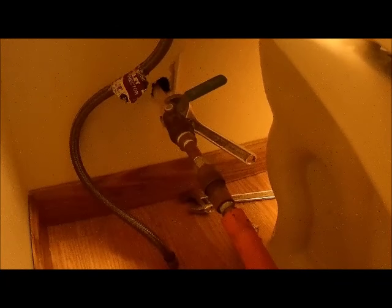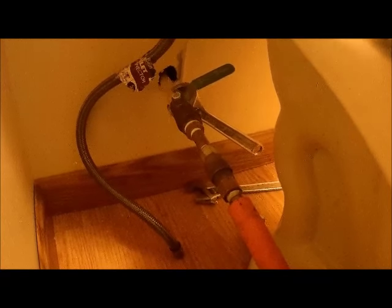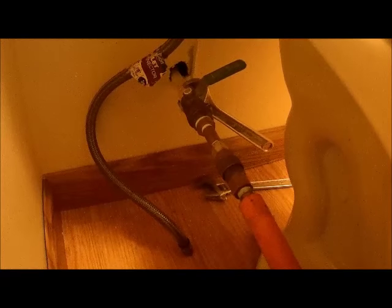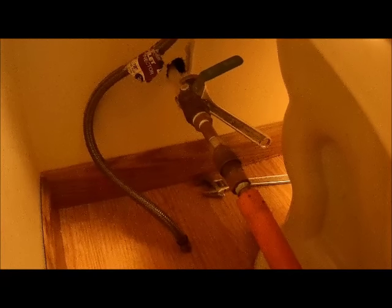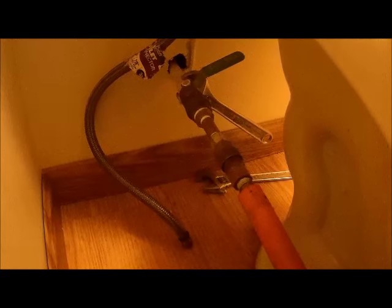Okay, I've got all the faucets closed, and I've got the air compressor turned on, so everything is hooked up. So I have my air coming in, and then it's hooked up into this shutoff valve to feed air into the water line. So I'm going to open up this valve. Hopefully, you can hear the air compressor kick in, and it'll take a little while to fill up the system with air, but